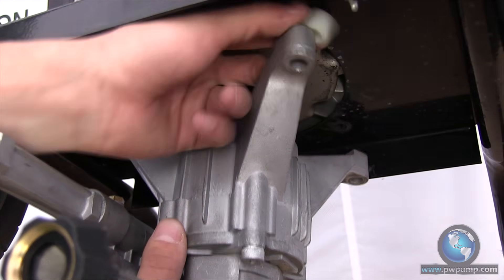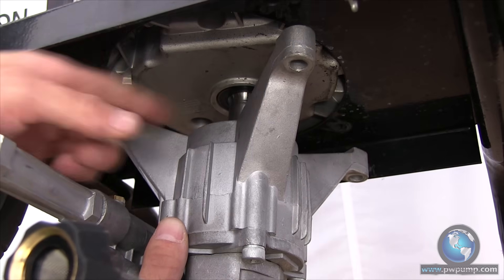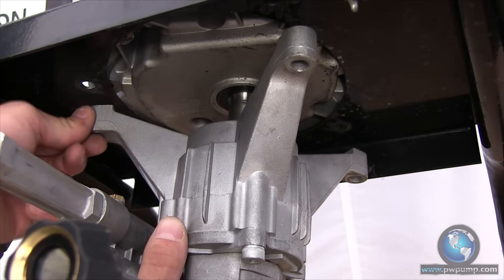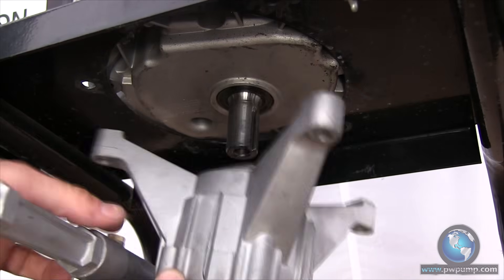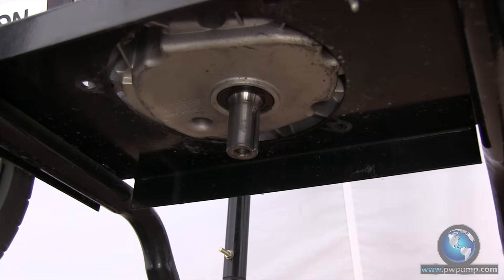The reason for this is that when you torque the bolts down at the end of the installation, a lot of force will be pulling on the leg causing the pump to tilt. But the shaft prevents it from tilting, and the result is a broken leg or broken shaft flange, which is not covered under the manufacturer's warranty.